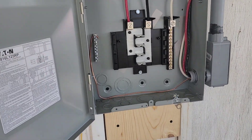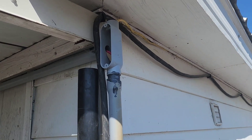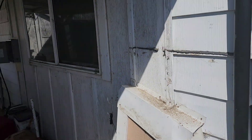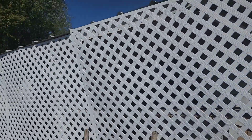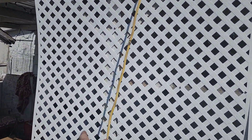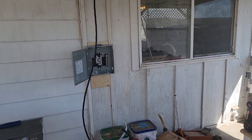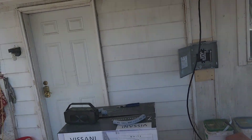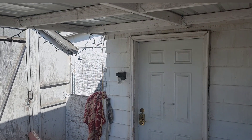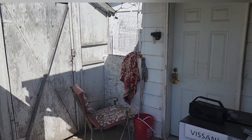Got the supplies run and installed. Now to start doing all of our circuits. I got both wires — the new wire and the one old wire that goes around the house — brought down into here. The water heater wire and the other wire, I yanked them and ripped out all the staples along the eave. Here is the hot water heater wire coming down the wall — we can cut it at the top and it'll have plenty of length to go into a box. This other wire feeds our freezer and a couple outlets on this side of the house. I'm going to bring it down, put it in conduit, and run it to this box rather than going all the way across.